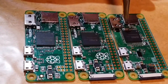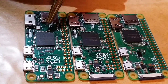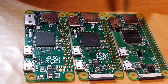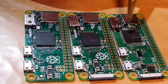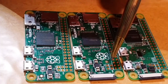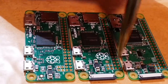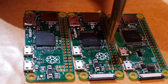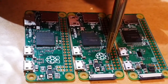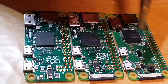The crystal was moved and rotated slightly, and this row of resistors is the same on the first two boards but is flipped around on the third one. The GPIO is the same, the composite is the same, and the power reset pads are the same. The probe points are all the same too, except the first board doesn't even have that test pin.